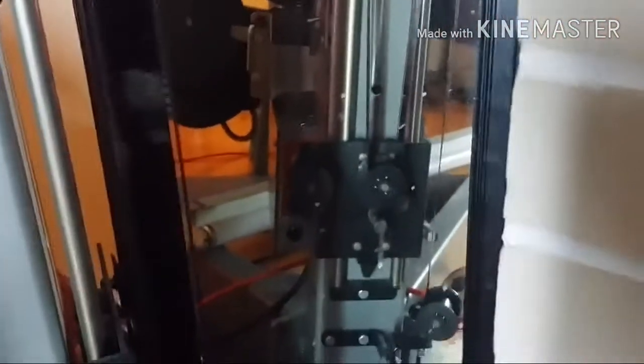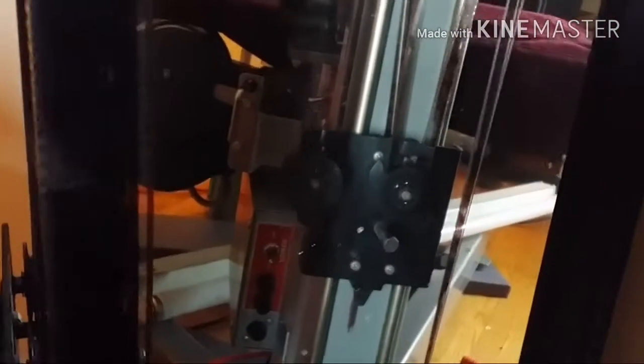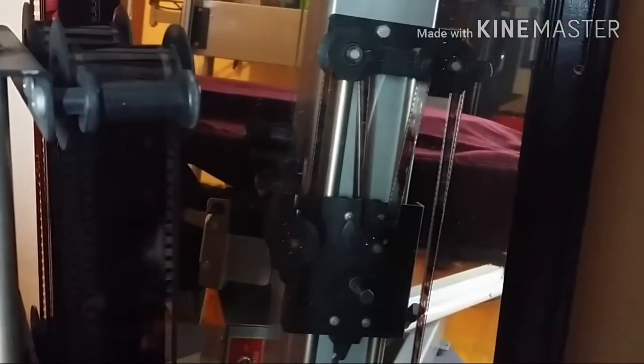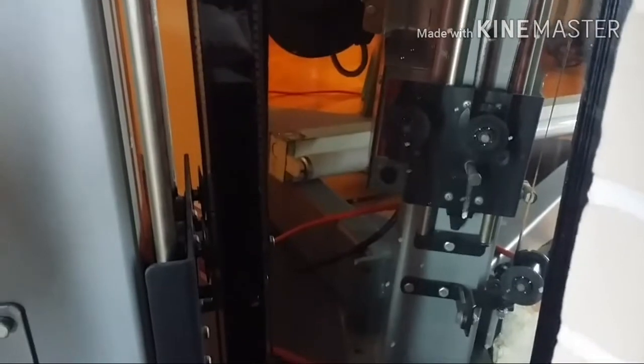Okay. Now the height of this plate controls this arm. The arm controls the controller, and the controller controls the speed of the take-up platter. As that gets bigger, it wants to pull on that film faster, so it needs to know how fast to travel, and that's what this device does. As that plate gets ridden up that track, it controls the speed of the motor. So, once you get past that tensioning device, we actually head to the infeed portion of the take-up.